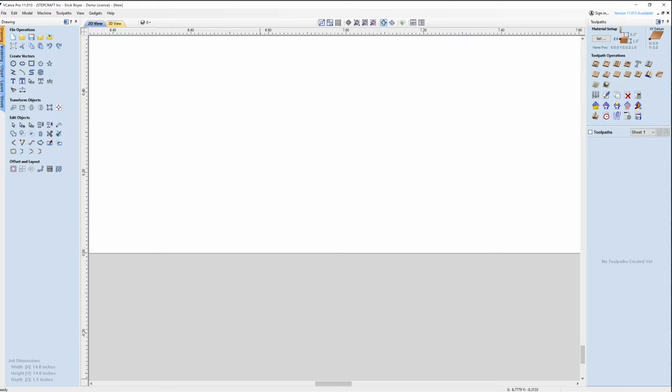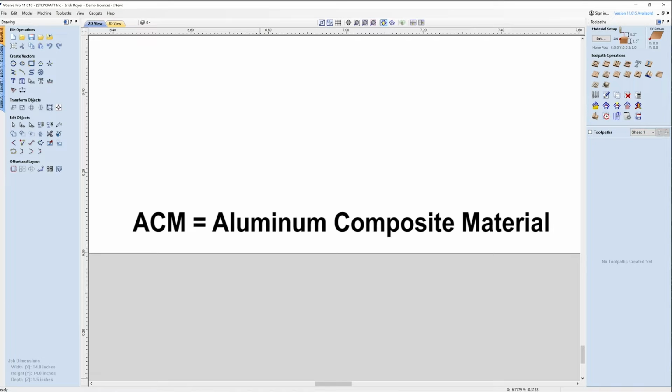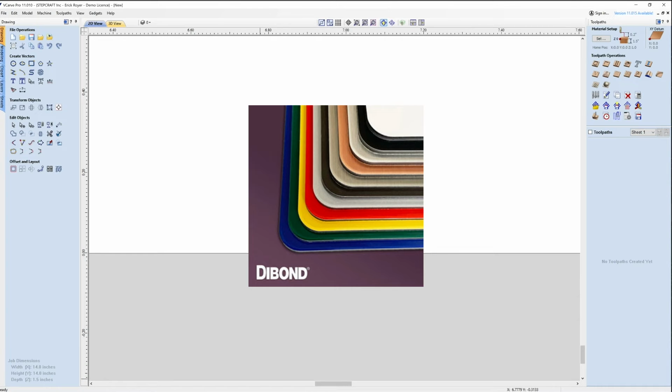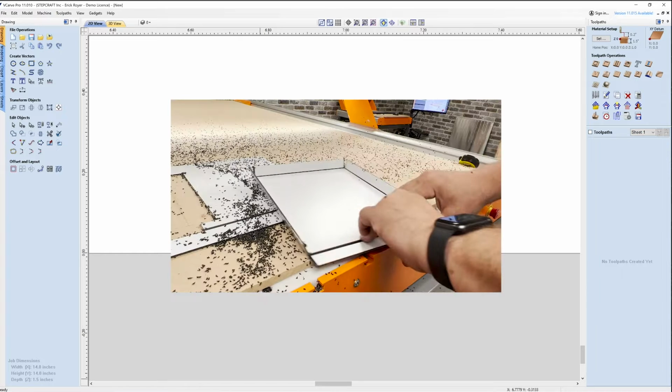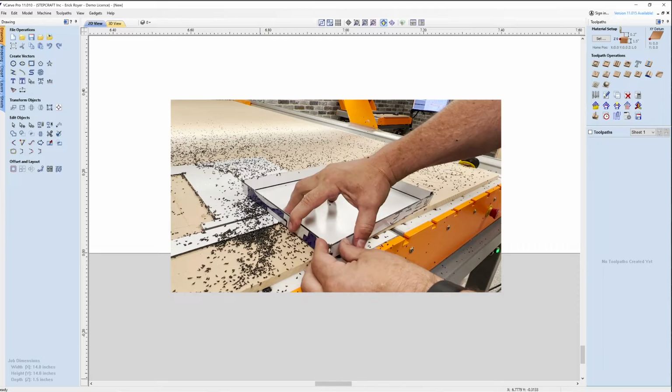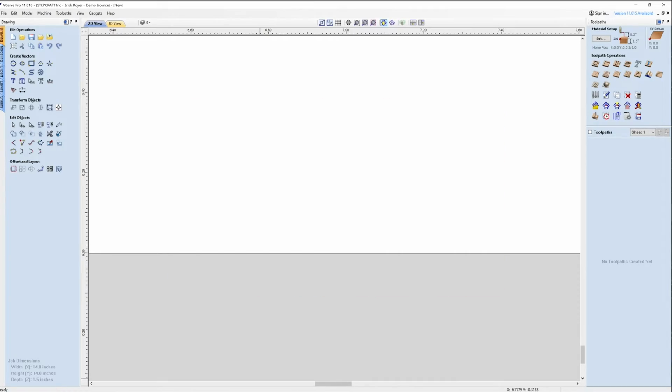All right, everybody. So I got what I think is a really cool video today. We're going to be talking about machining some ACM panels, or aluminum composite materials. You may also know them by the brand name like Max Metal or DiBond, which are really popular and used a lot in the sign industry. In this particular case, what we're going to do is make a sign box. So we're going to mill out the sides and the entire outside profile.